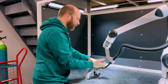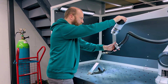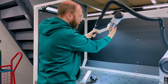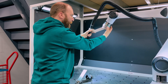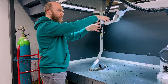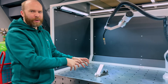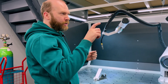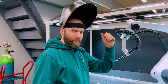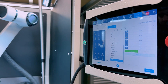That's where the welder will stop. After that, we make it free again — we want the weld to come back up to the top and wait. So we press free and point. It's going to weld that side, weld that side, then come back and stop there, waiting for us to remove the jig and put another one in. We put the welding mask on, check the parameters, turn the gas on, and press play. We get a start welding confirmation and the robot springs into action.